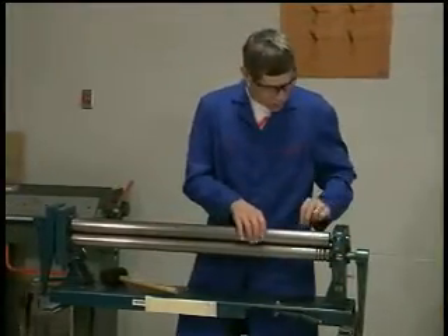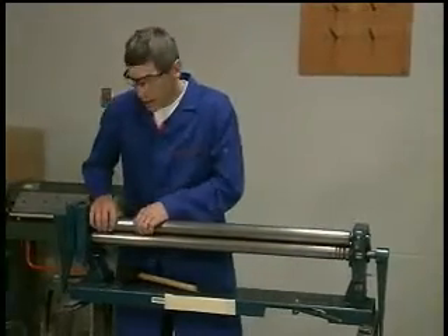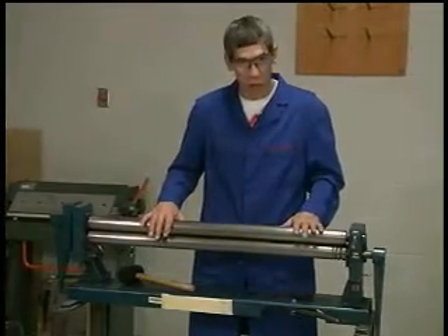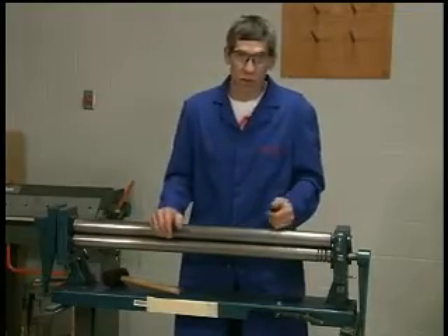When it is down firm, you'll see that the upper roller still has a bit of play in the bearing on this side and in the gear train on the other side, so there is movement in the upper roller that will have to be compensated for when we raise the lower roller to clamp our material.